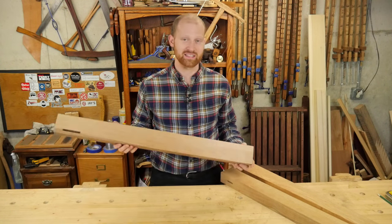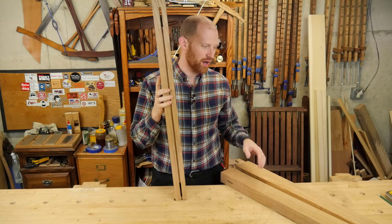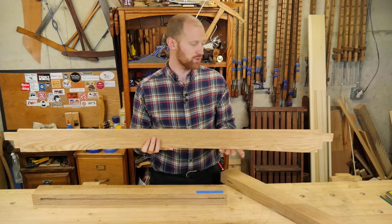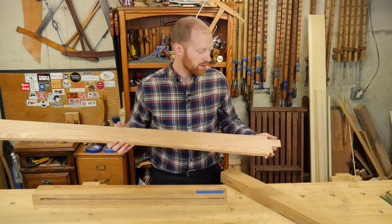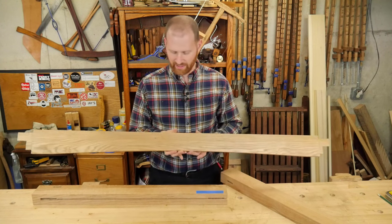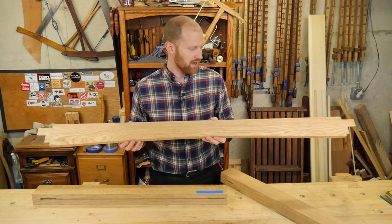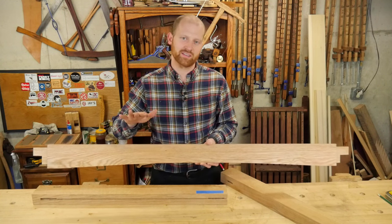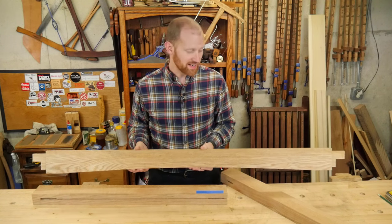The dresser is actually coming along and I am loving this project. When it gets done it's going to be one of my favorites of all time — this thing is beefy and huge and a lot of fun. I've been working on all of the main stretchers in this video: the front one has the arch, and the back one doesn't since it can't be seen. All of them are mortise and tenon so the tenons overlap with the stretchers on the sides. This particular stretcher determines a lot — not only the width but the height of the drawers and everything else.